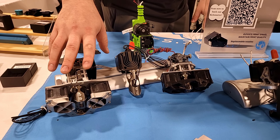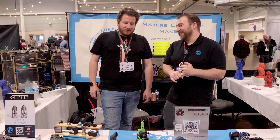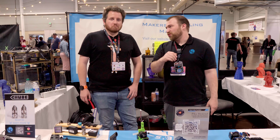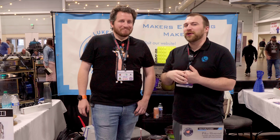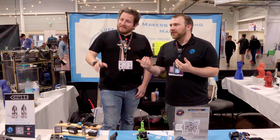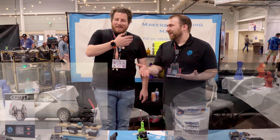Moving on, we have a Takeoff toolhead, SLM-printed aluminum — metal, because of course metal is better. If you have a certain amount of mods, you don't lose a single millimeter of build volume while still using all 52 millimeters of melt zone — 52 freaking millimeters in a 60mm overall length. We typically recommend anywhere from 100 to 140 watts in that configuration. It's better to have more than less — do you want to drive a Prius or a sports car?